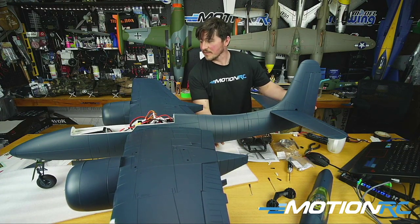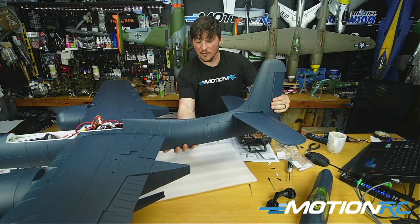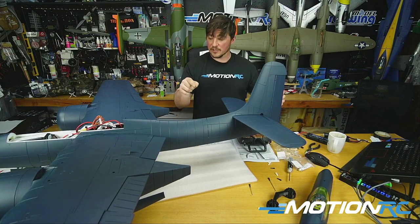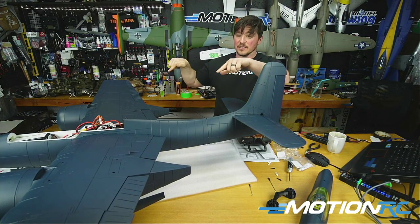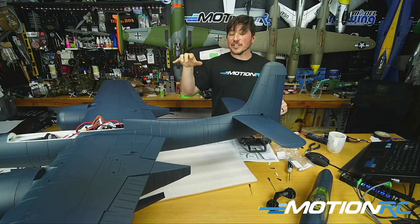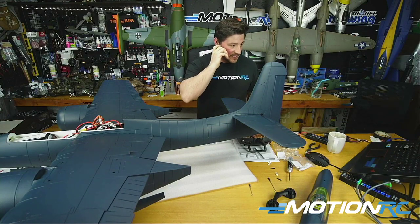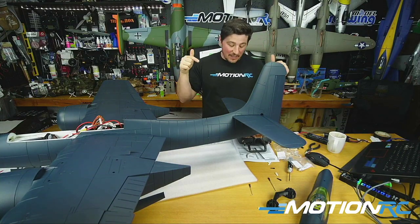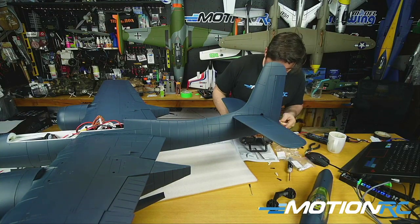All right. Don't have to reverse. And again, even when you're working with the gyro transmitter, there are direction controls on the receiver. That is not to control the direction your servos will go. It's to control the correction of the gyro on those control surfaces. You still have to reverse that within your transmitter when you get to that point.